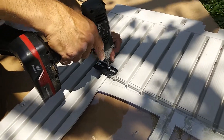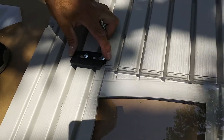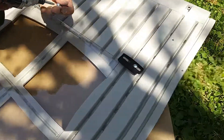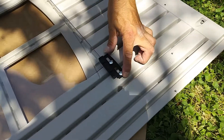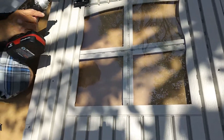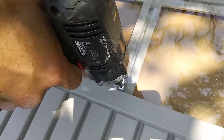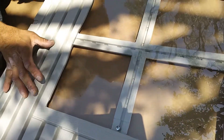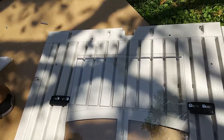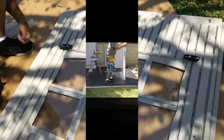Sometimes I put this window in after it's already up, because I like to keep the window open where I can put my arm through and either raise or lower the panel when I'm putting the walls together. The locks go on two screws — the same typical screws all over, they come with it, all in the same bag. Just zip them on there. I like these snug — give it a turn or two if it's too loose, because I don't like them wiggling around. As long as they're both on, they slide to the left and to the right so you can unlock and lock your window. Then it gets a set screw right in the middle at the bottom — a little set screw. I usually put these like halfway to three quarters of the way in. It's just a little stopper screw. If you want all four of those squares for ventilation, you can actually pull that window out, just like you saw me put it in, and then slide it back in the same way. Then you lock your locks and you're all set on that.